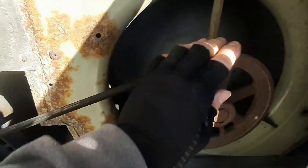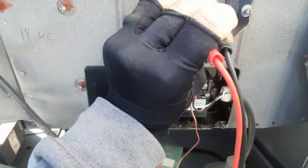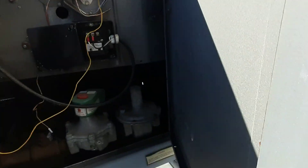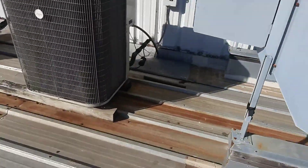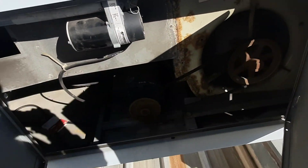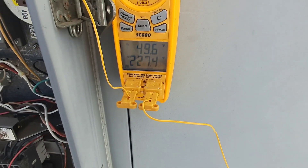I'm getting varying noise. Let's get the damper open, get the blower running. I'll bet the heat probably fires — check our high limit, looks like it is open. He's set. Now here it goes. The motor turns like crap. Get my plate back on — burner fired immediately. 226 degrees, no wonder we're tripping the limit.